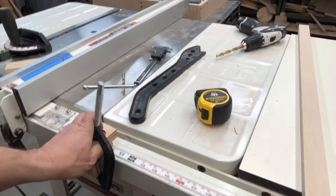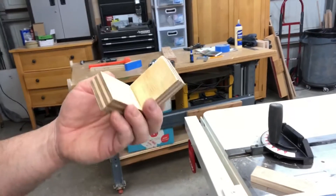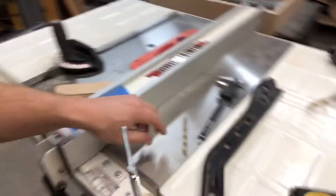You're gonna need some kind of stop for your fence. I just whipped up this little block — I used a Forstner bit to do a little recess so the clamp doesn't slide out, and it's just a little square block of plywood. I use a C clamp which makes it easy. To create the cut spacing I use drill bits. This doesn't seem that advanced, but drill bits come in every single size — I can go up in 64ths of an inch. This method is really accurate, quick, and gives a lot of versatility. You can use a pin method but it would be tough on a three-foot-tall board. I make note of my blade depth so if something happens I've got it referenced.